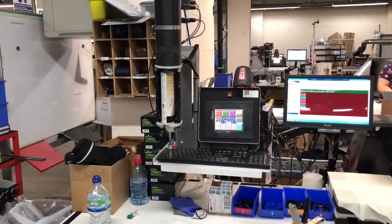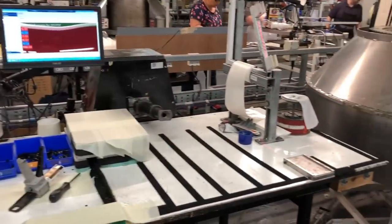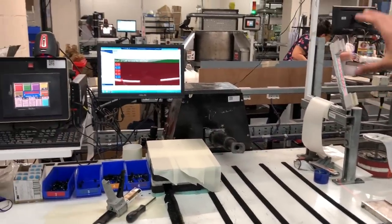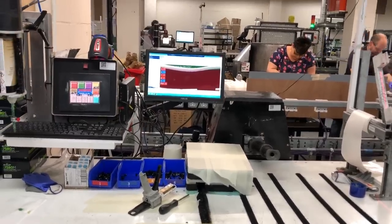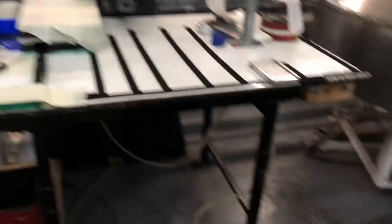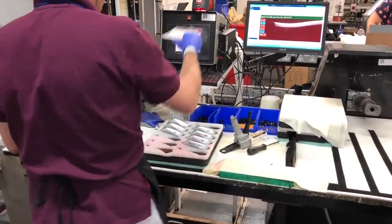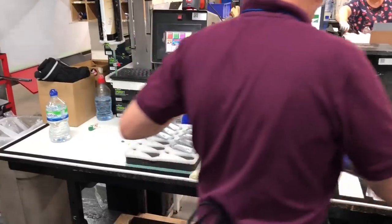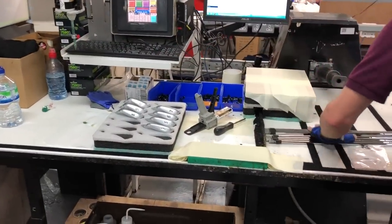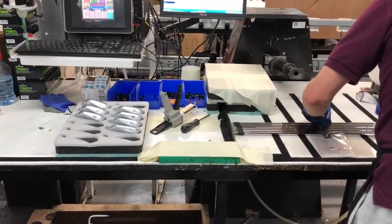The first stage of the process is what we call the knocking-in station. Here we mix the two-part acrylic glue, put some onto the hosel of the golf club and some onto the tip of the shaft. If it's a steel shaft, we use the air hammer at the back to vibrate the steel shaft into the hosel. If it's graphite, we use the knocking-in plate on the floor. Karsten Solheim was an engineer, so we use a tapered shaft going into a tapered hosel — it's still a very mechanical fit even without glue. If you were to knock it together with no glue, you wouldn't be able to pull it apart. The glue acts to keep the golf shaft concentric.